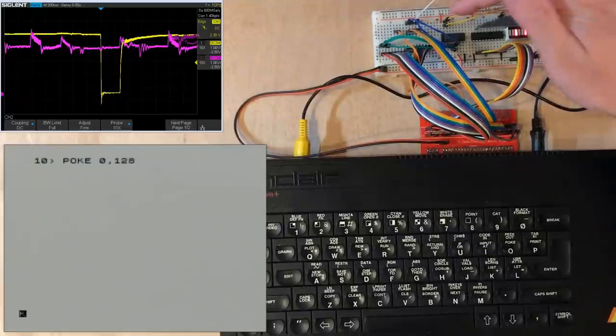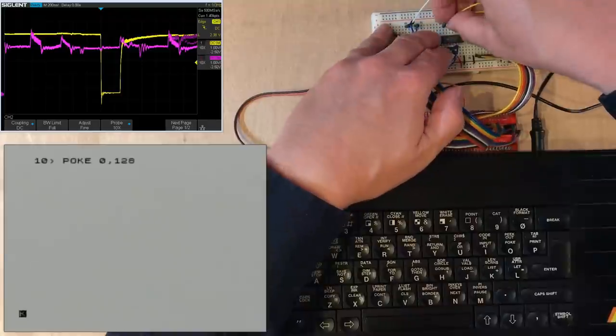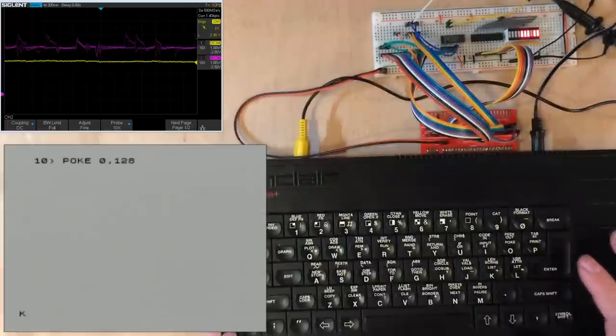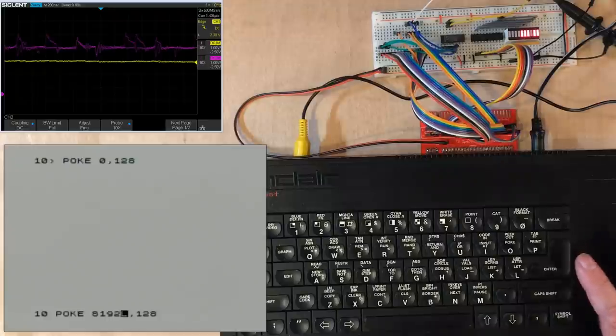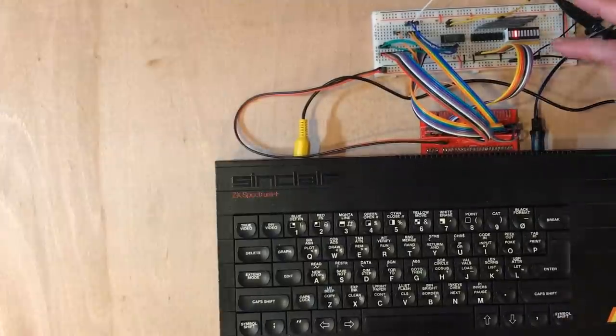Now, I wonder if we're decoding this slightly wrong or if there is actually some situations in which the code might write to that lower portion of memory. I got an idea. Let's move to the next 8K. See if we get the same thing. Okay, we didn't get the rogue update then. We will need to change that to 8192 to be the second 8 kilobytes. Yeah, that works.